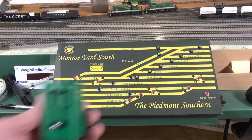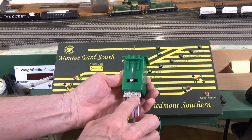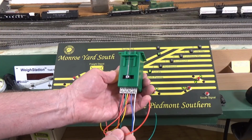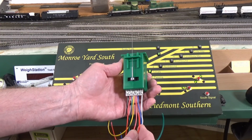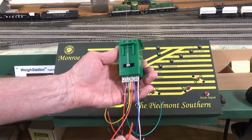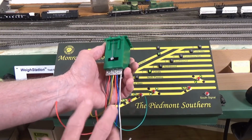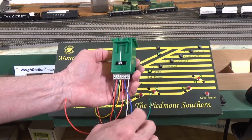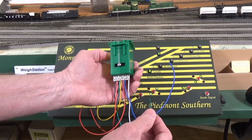And the way that I wired that, I simply used again, this red and the blue wire. So I'm only using 2 out of the 3 contacts here for this single pole double throw switch. This one goes to the power lead from the 2-volt power supply. And if you remember in the past, I showed you how to use the voltage dropping buckboards in order to create a sub bus. So I've got a 12-volt DC power bus under the layout, but then I created a 2-volt sub bus just to power these LEDs, okay? Because a green LED runs at around 2 volts. And then this is attached to the power going to that 2-volt power supply, and this one then goes to one of the leads on the LED, and then the other lead is directly wired to it.